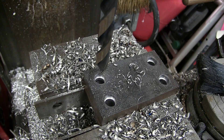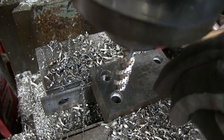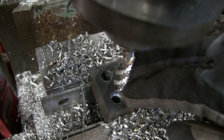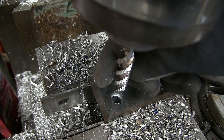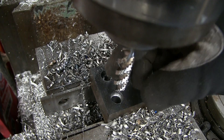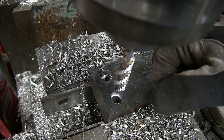Now we can go ahead and tap-y-tap-tap. This is a special machining tap - it makes one of those big long spiral chips that don't get clogged up in holes, so it ejects them. It's more expensive, of course - it's made for these machines. You can use a regular tap and do it by hand, but again, it's a smoke-'em-if-you've-got-'em case.